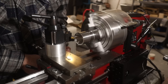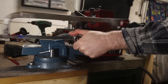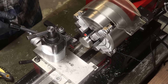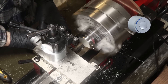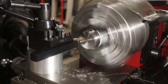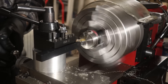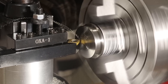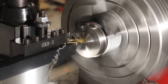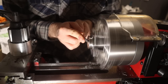Before we break down this setup, we'll add some chamfers, radii, and deburr the part as best we can, before we return to the hacksaw to pay our respects. I really need to get a bandsaw or a powered hacksaw — doing this by hand is incredibly dull. Now we turn the part around and dial it in for concentricity. I'm using a piece of soda can to protect the outer diameter from getting marred by the jaws. The first operation is a simple diameter. Now we only have one feature left to make: the dome on top of the piston. First, we'll face the piston to final height including the dome. Then I follow a pre-made table on the drawing — 13 facing cuts of 100 microns each, all to different diameters, building the dome geometry incrementally. Once all 13 cuts are made it looks like a dome, but to finish it off I resort to files and emery cloth to smooth out the steps.